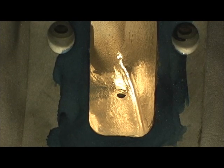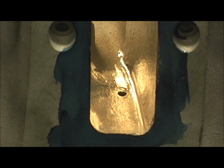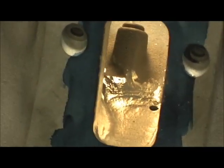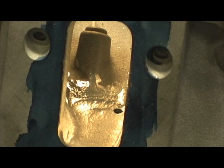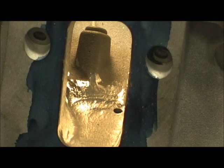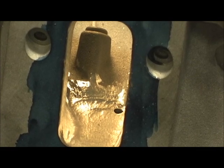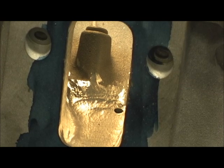So that's the raw material removal. We'll go ahead and start blending this. I'm going to show you how to roll it and keep around and not take too much out of that hump area where that spring perch is, but yet give it a good smooth transition so that the air can blend itself, come right up around the short turn and do what it's supposed to do.